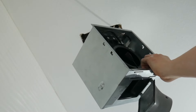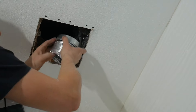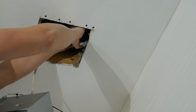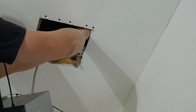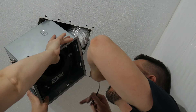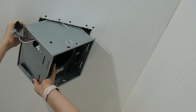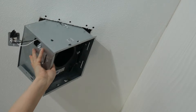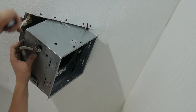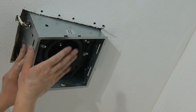I had to make the hole wider by about two inches. I took the cover of the new fan and checked that it would cover the new hole — and it would. I put the exhaust part back on the fan and used the metal pipe that was already there as an extender, putting it between two new hoses with zip ties around it. I had a piece of flexible hose in my basement, connected them together and connected it to the new fan, but it still wouldn't fit, so I had to cut another section about two inches wide.